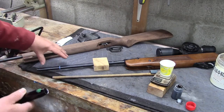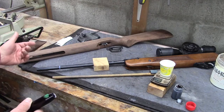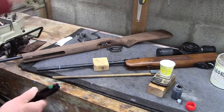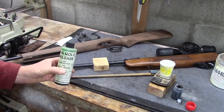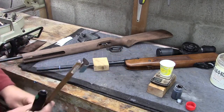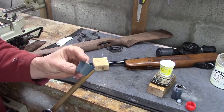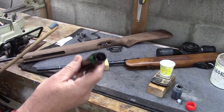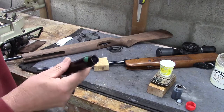Then I did Partall number two wax on the barrel - actually waxed the whole barrel in case of an errant fingerprint. It won't stick to the metal, not that it would because it's been oiled, but still I applied Partall number two, let that dry, and then PVA mold release - that's polyvinyl alcohol. It makes a microscopically thin onion skin that washes off with water. Then I made a flapper sander out of a dowel, cut a slot in the end with the bandsaw, stuck a little piece of machine belt sandpaper in there, chucked this up in the drill, and went inside the muzzle brake to give it a good scratch to get good epoxy adherence to the aluminum.